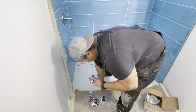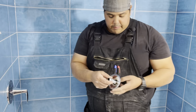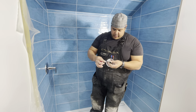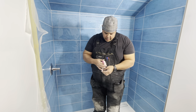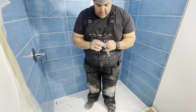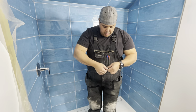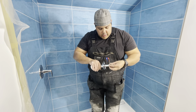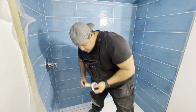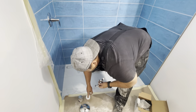We'll grab the escutcheon — so this long part will go into the wall, and this will slide over top. Pretty loose fit. So now we'll do some tape — we like to use three wraps: one, two, three. For this here, you can skip the first thread — I usually just go pretty close to the front first thread. And if I feel like it's going to go inside, I'll just push it off. This part doesn't matter because this is going in the wall, so you don't have to keep your tape nice and tight. So we'll just use a little dope, and then this side here has a washer, so we'll just use a little dope on the other side.